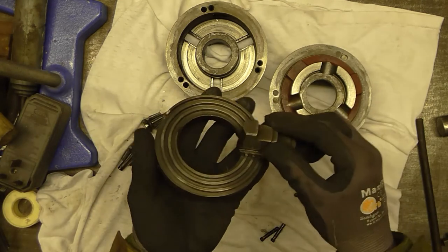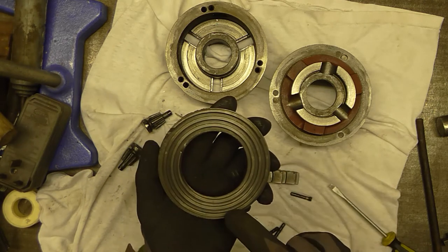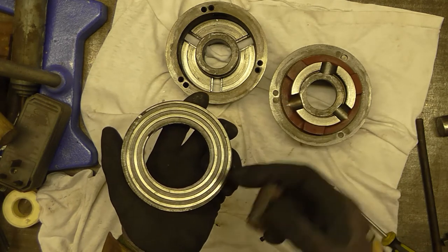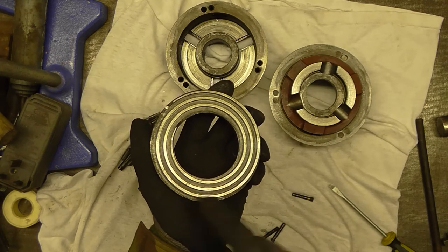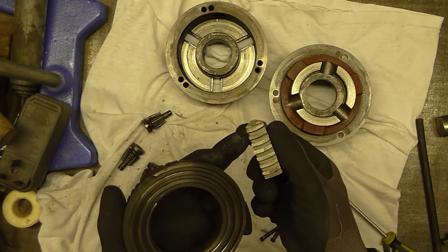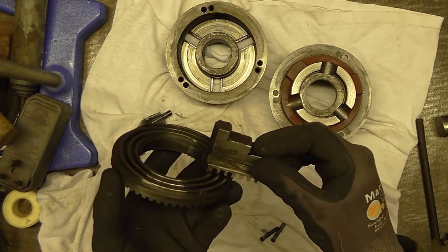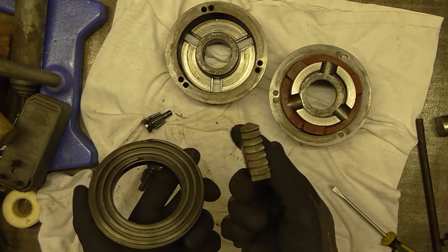Your jaws are engaging with the scroll, and there's a certain amount of backlash. This scroll, when it was made, will hopefully be of an accurate pitch. But the radius is of course changing — it's a tighter radius down here. The teeth on the chuck jaws have to accommodate all the different pitches: fitting here and fitting here, so they have to fit sort of badly at all the different positions. That's where part of your imprecision comes from — the fact that the tooth shapes are a compromise.